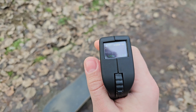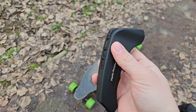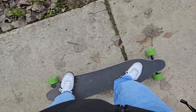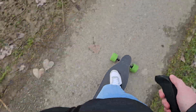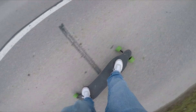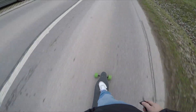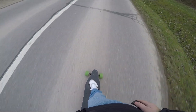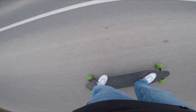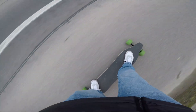All of this is pretty neat and simple to set up, but there is one thing with the settings that doesn't make much sense: there is no way to set your motor KV, so once you set all the settings the speedometer won't show correct values. To fix it, I played around with my gear ratio for a few minutes until the remote showed the correct speed, using my phone with a GPS speedometer app to help calibrate it. Once you power on everything, the remote connects instantly and the connection is solid — no dropouts or weird glitches like I had with my old DIY remotes. The speedometer becomes really precise once you tune the settings, and the battery charge bar is easy to read for estimating remaining range.